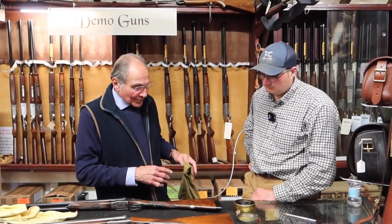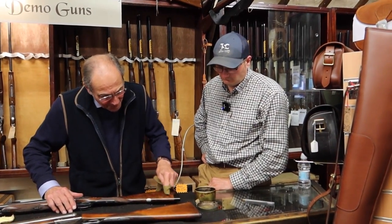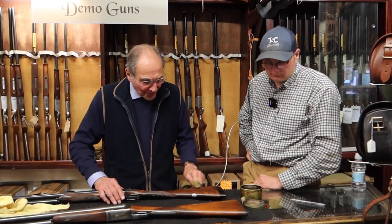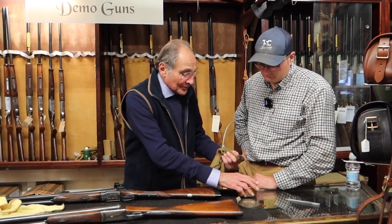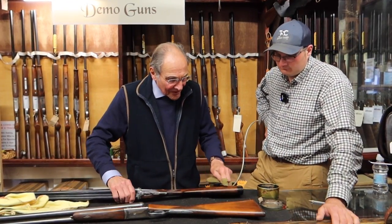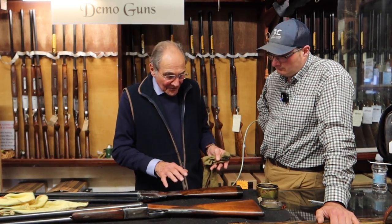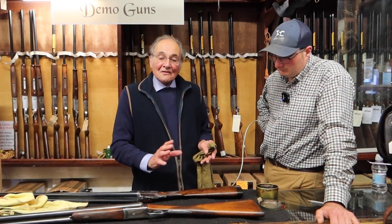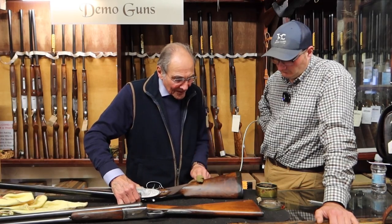To start with, just get a little bit of wax and give the stock a nice coat like that. The beauty of this wax is it's completely natural — it's made from beeswax and alkanet root. Alkanet root is a wax colourant that was used traditionally a hundred years ago on English gun stocks. It gives them a sort of a reddish hue. If you've got a light piece of wood it will make it reddish; if you've got a dark piece of wood it makes it go black. So not only does it wax it, but it brings out the grain in the wood as well.